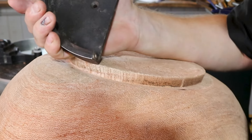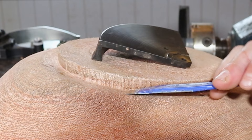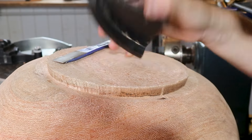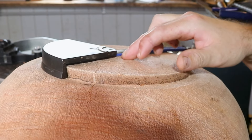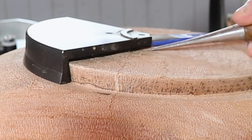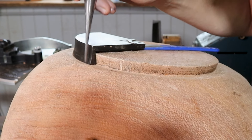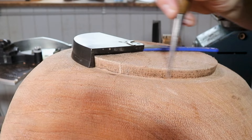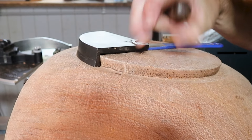When preparing your tenon — I've taken the dovetail jaws off to show you — you can see inside there that I have a nice flat section meeting to that corner, that shoulder of my dovetail jaws. I do that with the skew when I'm cutting my tenons. When I place this tenon section up against it, you can see it fits just beautifully, with a gap underneath so the tenon isn't bottoming out in the base of the dovetail jaws. They say to have a perfect circle when closed; if there's a slight gap you'll get away with it, but I aim for a perfect circle so it's squishing all those fibres together for a really strong hold on the timber.